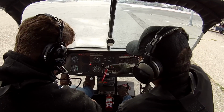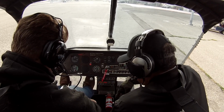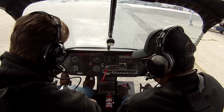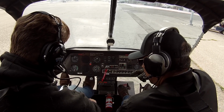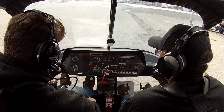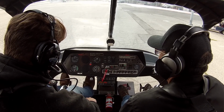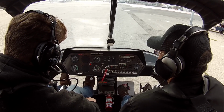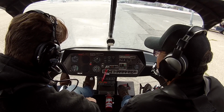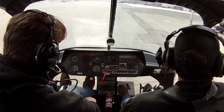Yeah. Now what you're going to do is stare at this and try to keep those RPMs at 15. You might have to add throttle because remember you're adding friction now. The belt is tightening up on those pulleys. So you're going to bring it up nice and slow. Let it gradually start picking up speed on the rotor blade. And if you notice the RPMs start sinking, then you add a little bit of throttle. Because if you go up really fast, it's going to conk the motor out, because that's a lot of strain on the motor, you know? Trying to rotate something heavy.